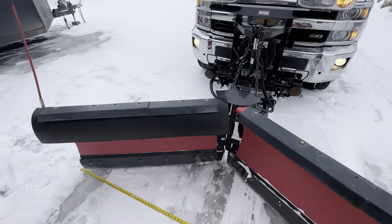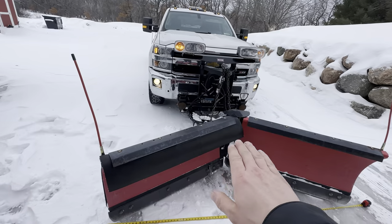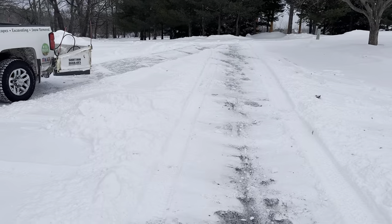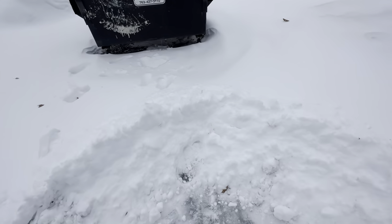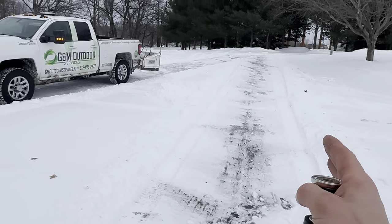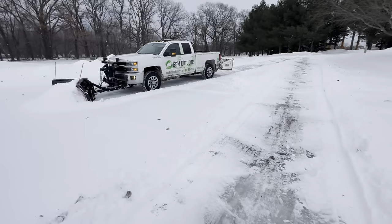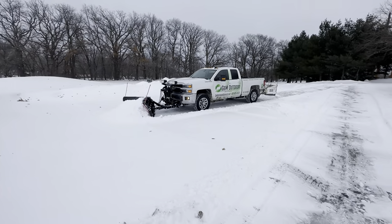Other than that, if you're talking about overall — if I have one plow, it's definitely not a V-plow. It is pretty simple overall, not a ton of moving parts. This one has spring live cutting edges, which are nice. Since only the weight of the plow is pushing down, if you hit anything the edges will trip or just bounce over. In V-mode you can see there's not much in front — the snow falls right back in. I'm driving over it because even an 8'6" when it's V'd is only a little over seven feet.